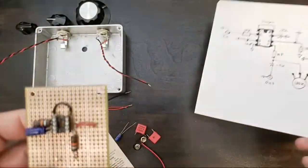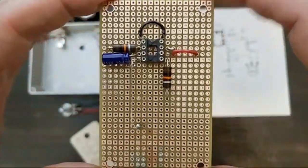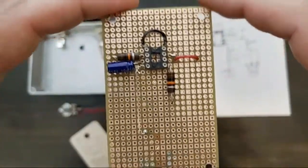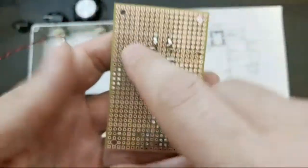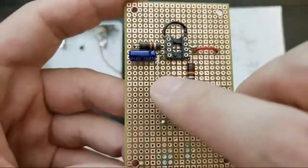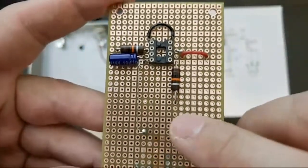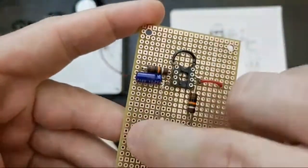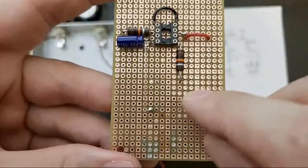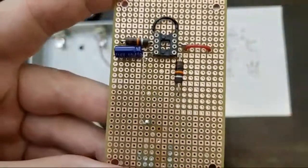Casey asks, why are these sometimes called breadboards? I don't know the specific name behind breadboard, but there are some types of boards that have a connected underside, like a strip. Essentially, this wire here that I created is called a bus. Some breadboards are all single buses for the entire length of the entire board. That way, when you make a connection from one side to another, it would automatically connect.